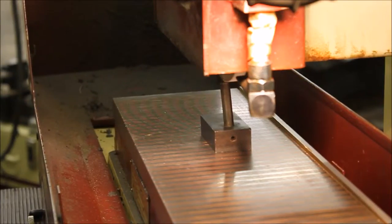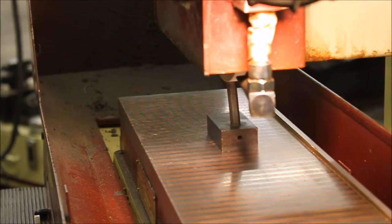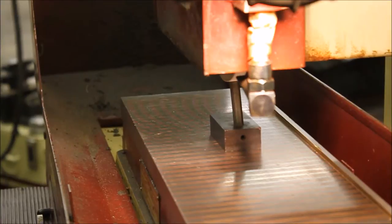Make a light pass across the face at this point. Ensure that your depth of cut is not more than a thousandths of an inch, as too deep a cut may damage the wheel dresser or the grinding wheel.